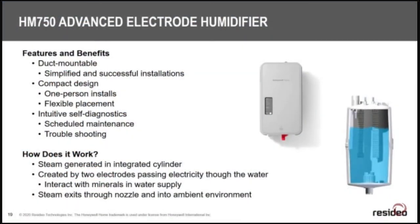It's on-demand humidity, very flexible. You can hang the steam humidifier directly on the plenum, or use the included 5-foot remote hose kit — you only need a 2-inch hole in the plenum to inject steam. A 15-foot hose kit is also available separately for longer runs or downflow applications, but 15 feet is the maximum. You can also wall-mount the unit — it's very compact and weighs only about 12 pounds when full, so you need a solid surface like a 2×4 or sheet metal to mount it.